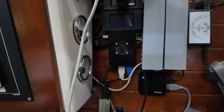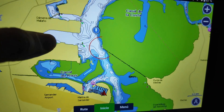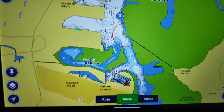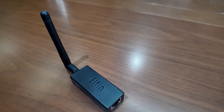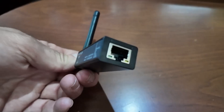Almost all of you agreed that you wanted a simpler solution — I still think the best solution is a Raspberry Pi for all the things it allows you to do — but we have listened to you, and today we are going to show you the cheapest and easiest way to connect an NMEA 0183 device to the Wi-Fi network of our boat or directly to our tablet via Wi-Fi, spending less than 12 euros, all thanks to a tiny device called the Elfin EW10. For the record, we have done this episode for you — I already had it solved with my Raspberry.